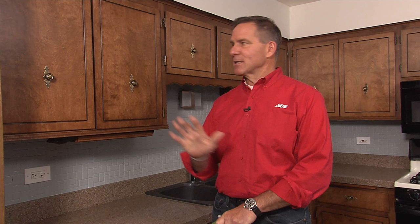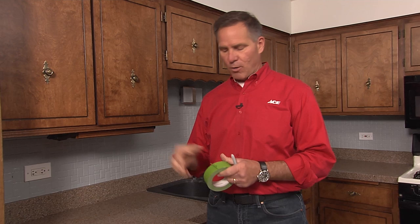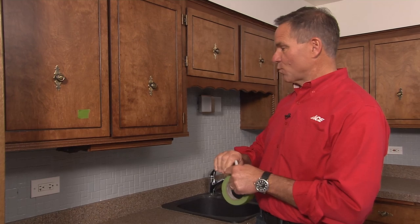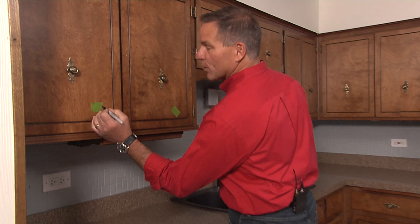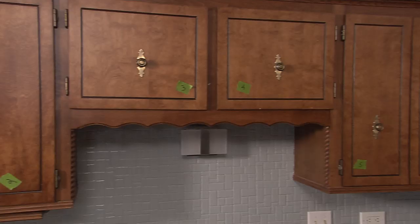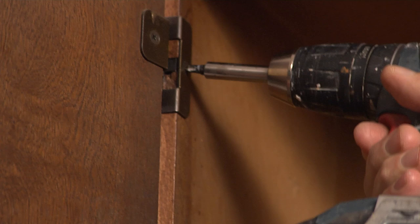To get the best results when it comes to painting kitchen cabinets, take the doors off of the boxes and take them to the garage or outside on a set of horses so you can clean them, prime them, and paint them out there. When you take them off, you'll paint the frames the same color, but remember where the doors go. Take some masking tape and number them — going left to right, wall cabinet door one, door two — and place a corresponding piece of tape inside the cabinet. Once they're all numbered, take the doors off, take them outside on top of a tarp, and take all the hardware off.